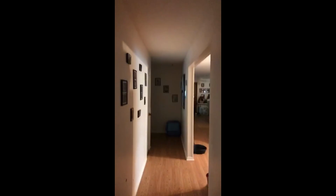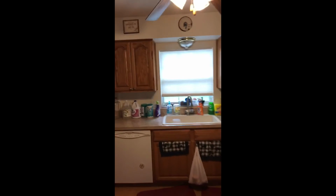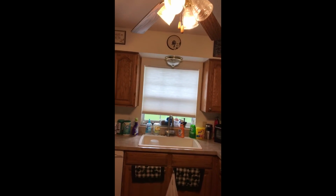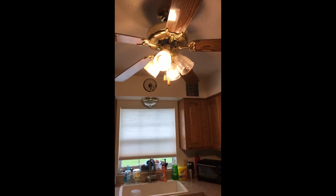Oh, last thing, if you're running a generator, all the light bulbs here are LED. You're going to get a lot of flickering, and you may lose an LED. Remember, when you're running a generator, if it's not a really high quality one, and by high quality, I mean a 20 kW diesel with a good voltage rectifier on it, you're going to see, it's kind of hard to see here, but the lights are blinking a little bit.